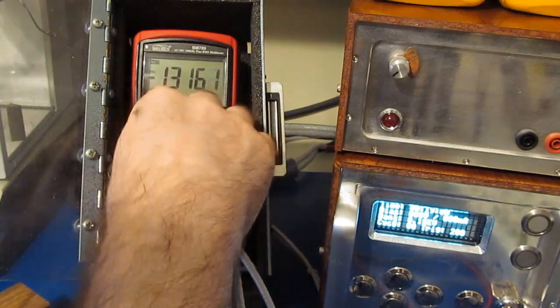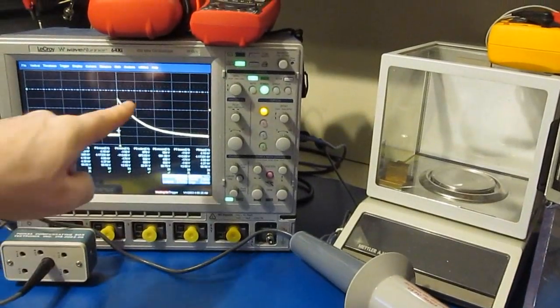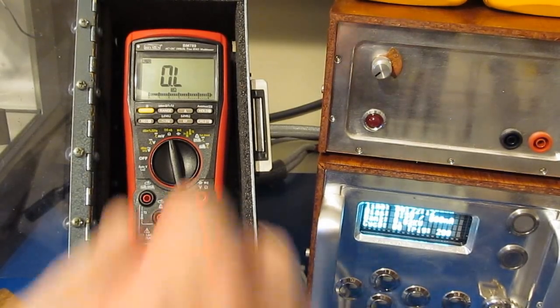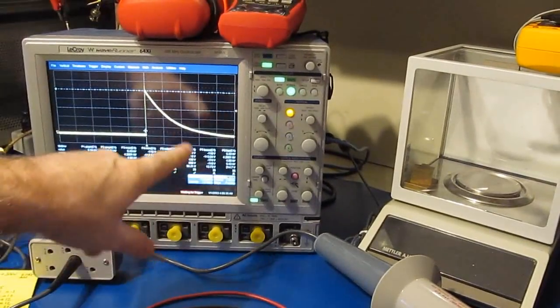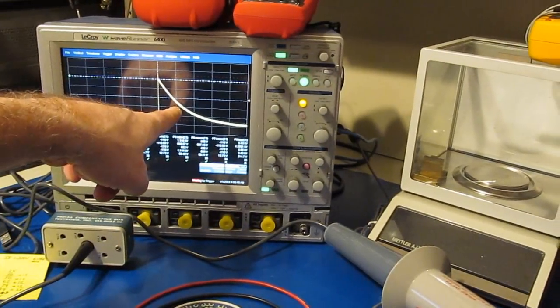Okay, that's it. I'll go ahead and functional test the meter. This was the last transient that was applied, and again, we can see there's no signs of any breakdown occurring. So the 789 passes functional, so that was 4,000 volts. I've gone ahead and reset our generator for 5,000 volts peak. You can see it here, so this is now five divisions up. And again, at 2.5 divisions up, we are one division over, or 100 microsecond full width half height.